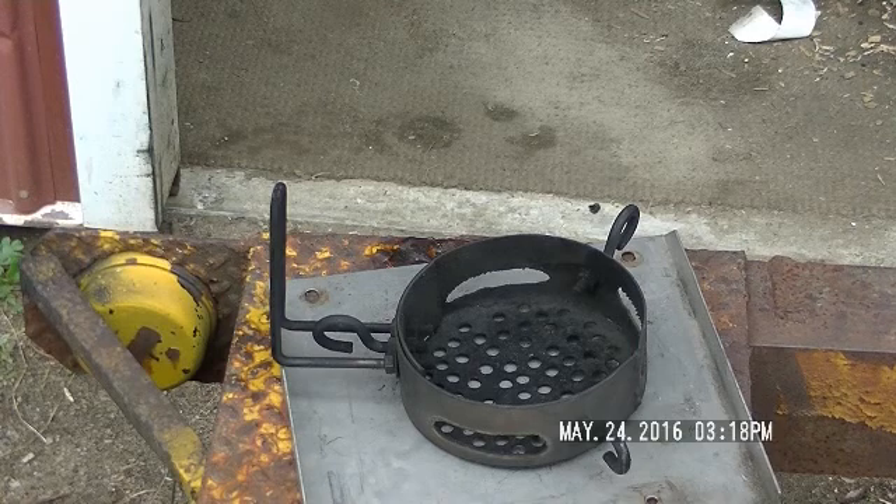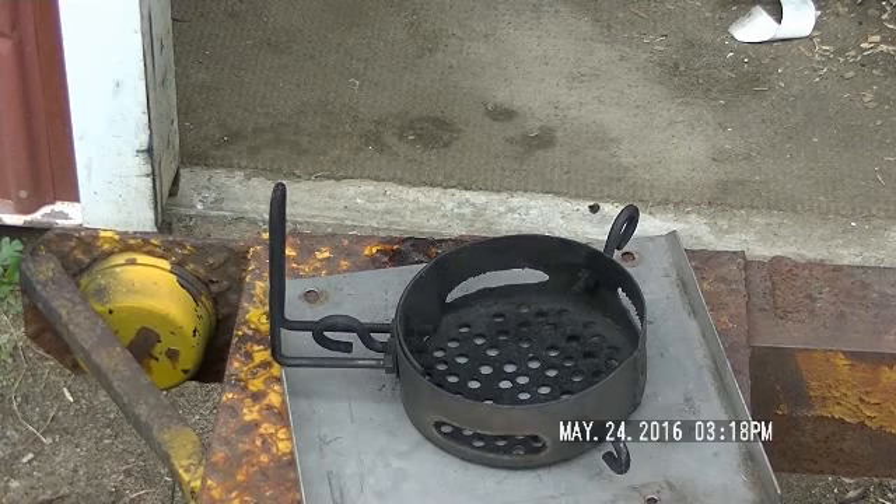It's also allowing the charcoal to escape. I don't get much ash - I get little chunky granules of carbon, but no ash down below. So it's not really burning completely down through - once it gets down to that point, it just plugs. I'm hoping this is going to be a longer term help to keep the consistency of the gas moving. I'm going to pause and hook this back up in there, start her up quick and give you a show.